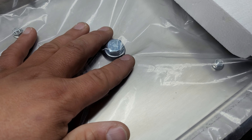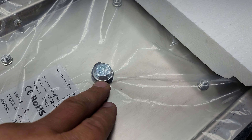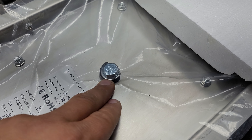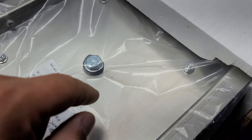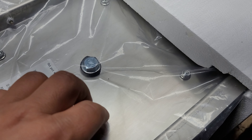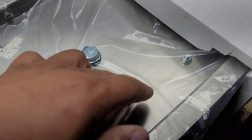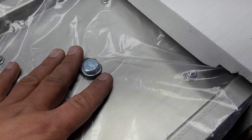This is a brand new inverter. But even though it's brand new, what you can see here is this insulator is actually starting to break. I have to replace this insulator because if it gets much more broke than that, it will end up just breaking out. Then what will happen is this bolt that has a lot of tension on it — at least this bolt head will be allowed to move up a quarter of an inch up and down. That seems like it wouldn't be that big of a deal, but it actually is because it does allow the transformer to wiggle. And this will be allowed to move because then it can pivot back and forth.